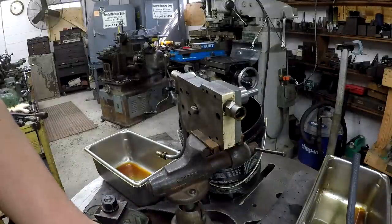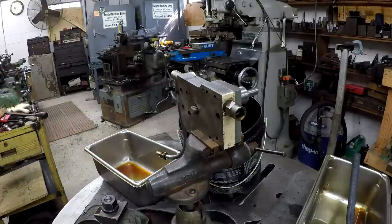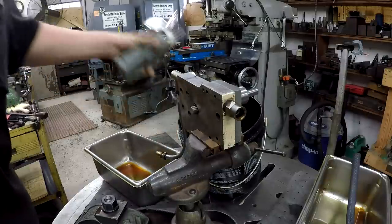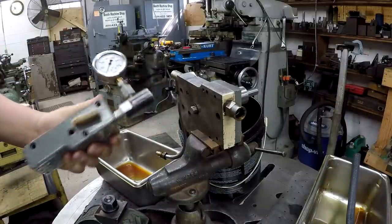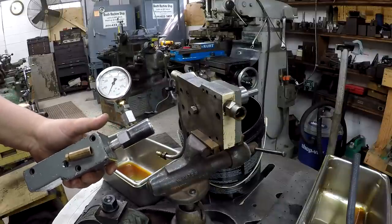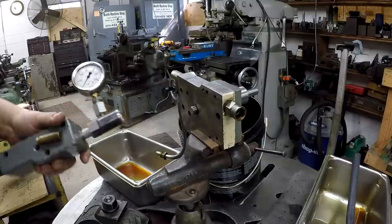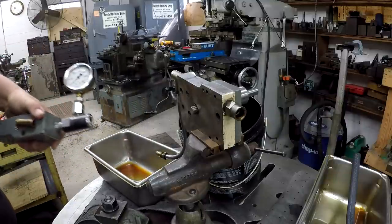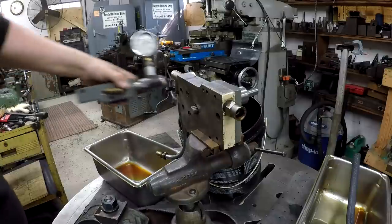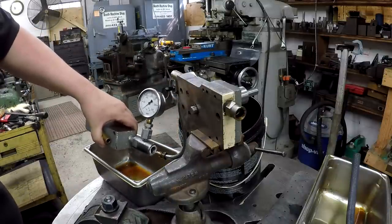We're going to do another test on this hydraulic pump for the Kearney Trecker. What we're going to do is test the pressure relief valve, which is this guy here. You guys might have seen this in a past episode. We were testing it with a hand pump, okay? We're going to go ahead and hook this up, and we're going to use our drill motor to run a test. So we can hook it there